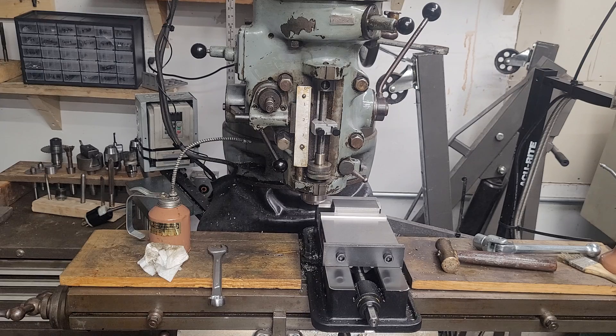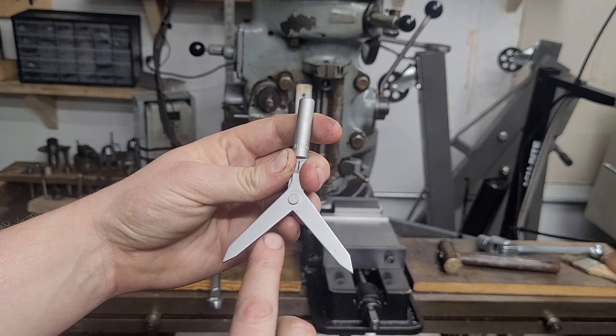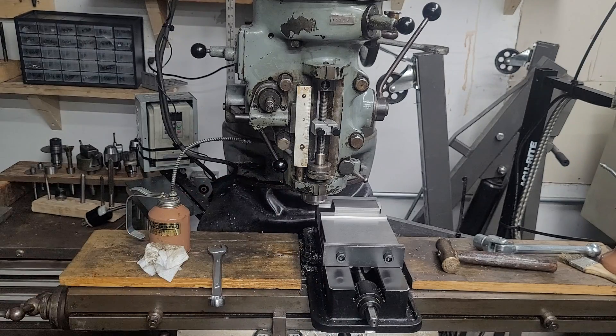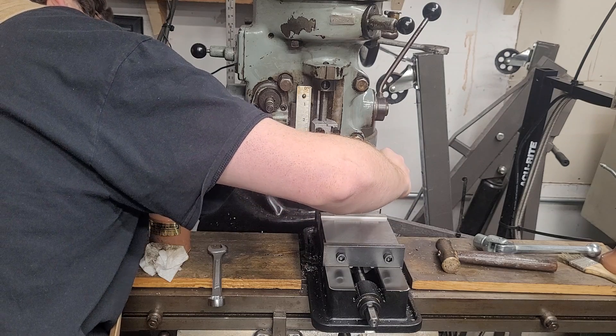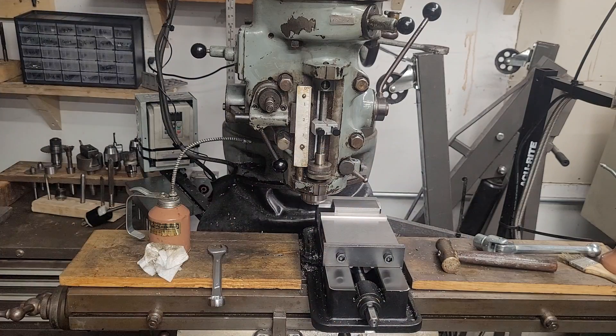That last tool I showed you is a really good compromise between speed and accuracy. It will actually work on square parts if they fit in between — you only ever contact on two points, so for square parts you can still use this as long as it fits. Even for round parts, you think this is just for round parts, but you can use it for square parts too. It wouldn't help on this particular part because it hits the vise before it hits the part, but as long as you're clear of the vise, it'll work. You don't have to use an edge finder — you can use an end mill to find the edge of a part. It's less accurate, but it's quick, and sometimes all you need is speed.